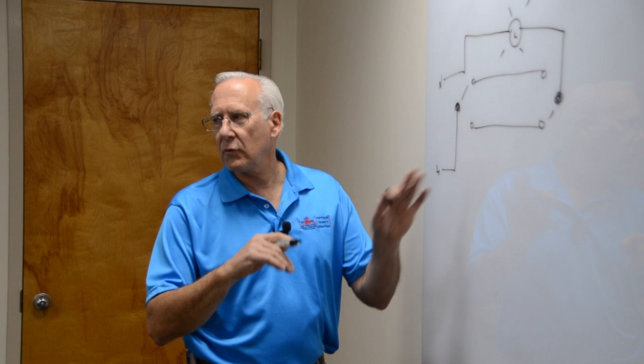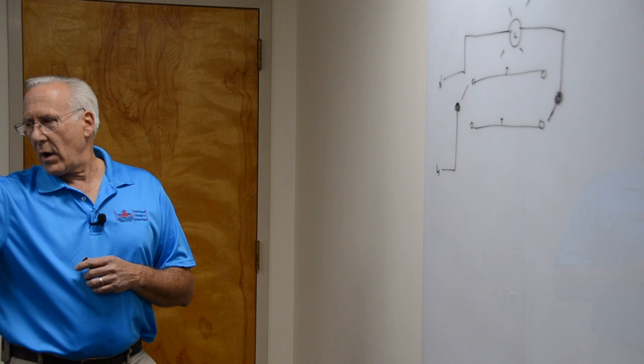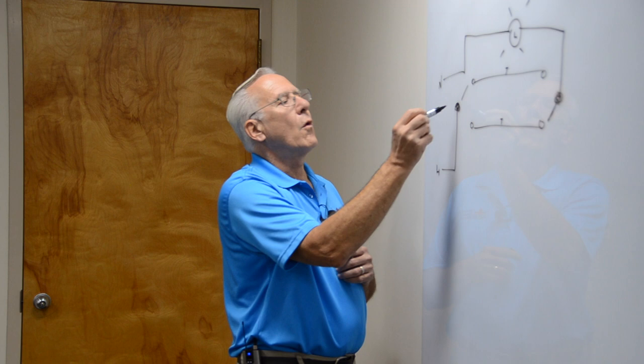Three-way switch, right? So power goes in, goes through the traveler. These two are called travelers. On the switch, which you see, you can put the travelers on either wire. It doesn't matter. They're not sensitive to which one goes where. Just as long as you hook up the travelers. This is the sensitive wire. One of them has to be the feed to the device, the color terminal. Okay, you got that?